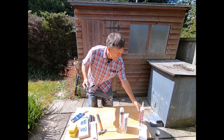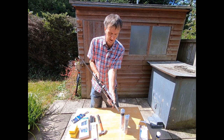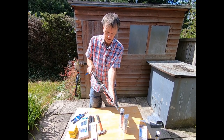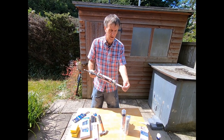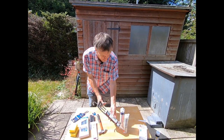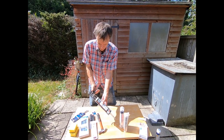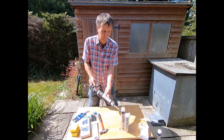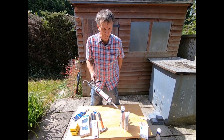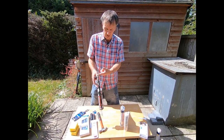You pull the lever up, the silicone tube fits in, and you press the lever forwards down to where it needs to go. Once fully forward, you're ready to operate. Apply a gentle pressure to dispense silicone or Painters Mate. When you finish, you must always push the button to release the pressure, otherwise the material will continue squirting out.